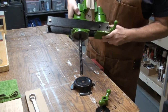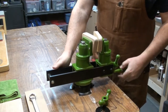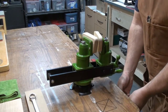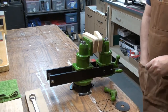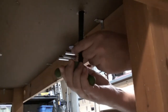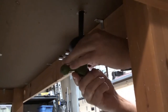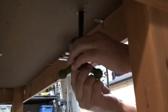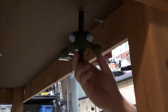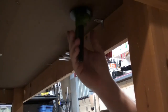Drop the base down and lift up the vise, bolt it in. You have to make sure you locate this so that the handle is off the bench, so you don't bash your knuckles against it. Then put that big butterfly washer under there. Here's the under-bench view — spin it on, you can tighten this right up so it doesn't move, or you can loosen it off just a touch and that'll let you spin the vise around 360 degrees. Pretty simple installation.